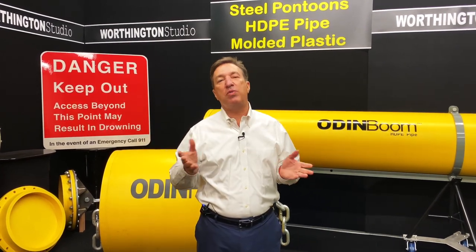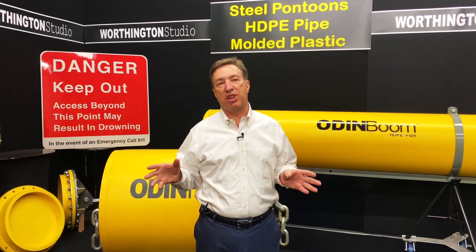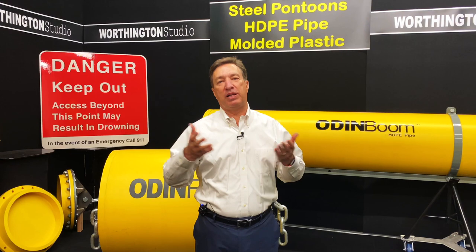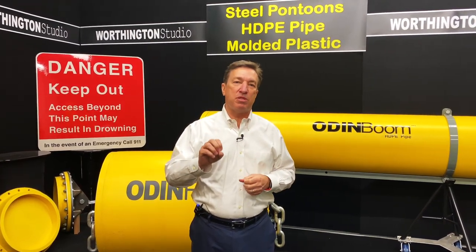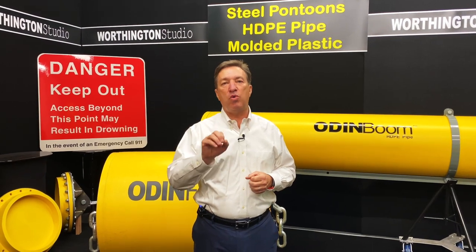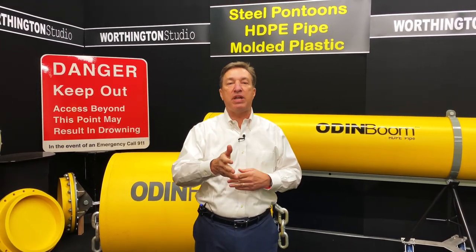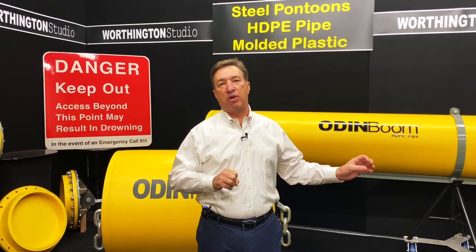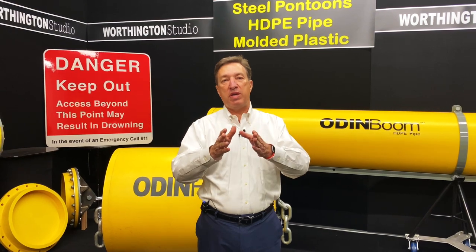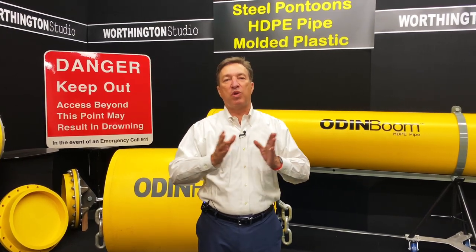What is ODIN? Well, it's an HDPE barrier line, and we have different styles of barriers within that line, which is why we call it a series. What makes it special is that ODIN series is based on thick-walled co-extruded HDPE, and we're going to show you what that is. Later in the video, I'm going to show you the difference between our ODINBoom and our ODINFloat. So ODIN series has ODINBoom and ODINFloat, and we'll explain the difference with co-extrusion.